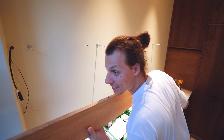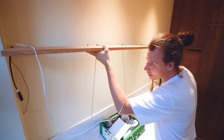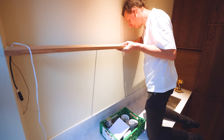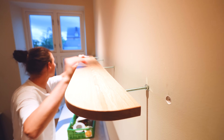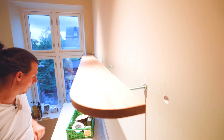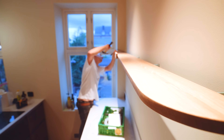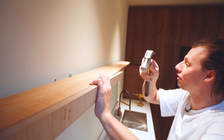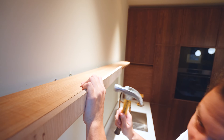And all that's left is the scary part — let's see if this thing fits. It won't be easy to line up all the holes, and with all the friction from the threaded rods, it probably won't be easy to push on. That's all the bolts at least started in the holes. If this doesn't go all the way, it'll be such a nightmare to get back off. I also ended up drilling the start of each hole slightly larger for the nut to fit inside.